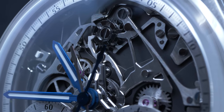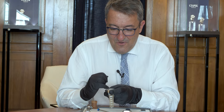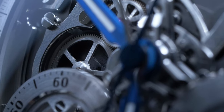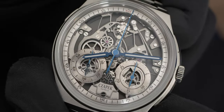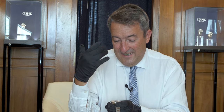If you look now at the detail of the chrono mechanism, you can see that all the steel levers, which are satin-finished, are also chamfered — hand-chamfered. So it's a revelation of craftsmanship, a tribute to craftsmanship with so many angles hand-polished like mirrors. And the beauty is of course to action the mechanism and see all of them move, as they were in the initial model from Valjoux. Now of course we've gone to another level in terms of complexity and execution.